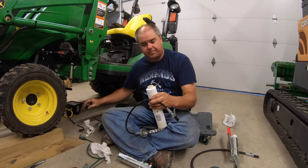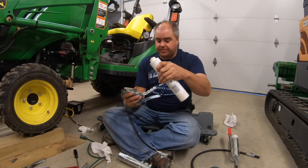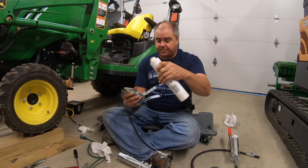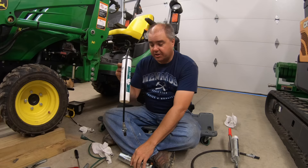The tube is threaded right into the gun. If you've got a brand new tube, you just push it up a little bit. In this case, since it's almost used, I have to use a screwdriver to reach up — but you basically push that up a little bit until the grease sticks out, and you stick it right on there. This provides a way for you to change the type of grease you're using, even when a tube's not empty.